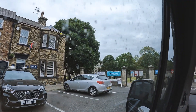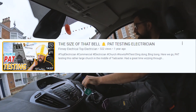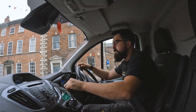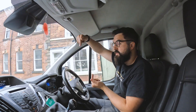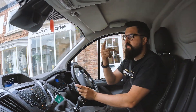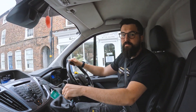That's the new plan. Oh, we're also in Tadcaster — if you remember the church video, that was just down the road, the big church pat testing. So we've just been to the wholesalers and got some 20mm conduit from a job. We're going to bridge between the fuse boards with maybe five conduits — 6mm cables in one, two 2.5mm cables in another, lighting cables in another, earth in another, and one spare in case they want to add stuff later.